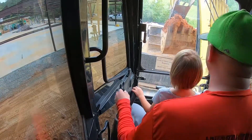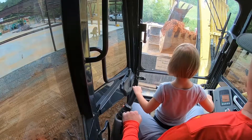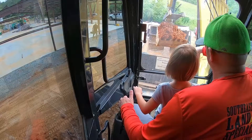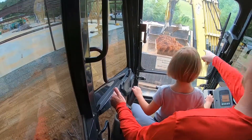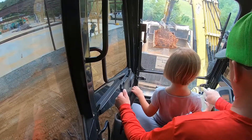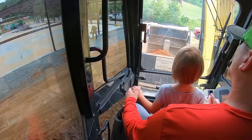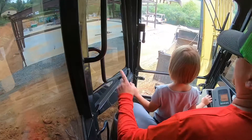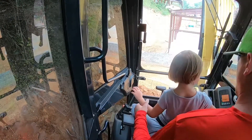Good. Now see how you're centered up with the center of the truck? Yeah. Hands on controls. Nice — now real easy since it's heavy, push this one forward. Keep going, that's good, hold it there. Now see as you lean that forward, that bucket's starting to tilt down and the dirt's wanting to move. So let's push this one forward instead — push it forward, good, stop. Push this one forward as far as it'll go. One more. Good. Now curl your bucket out. Now as you do that, pull back on this one. Good, we'll work on it. Nice and easy because when your boom's way out like that, it's easier to tip. See how it's starting to wobble? We're going to push the blade down to stabilize us.